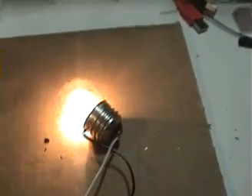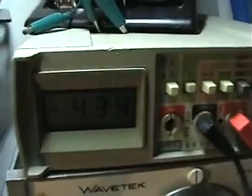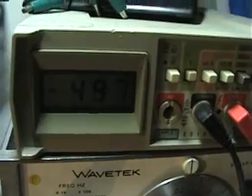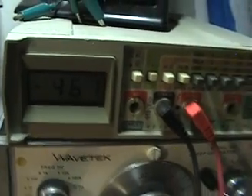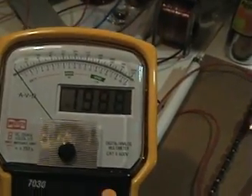The bulb is fully lit — I'd say there's probably about 150 volts. I can't measure it because my equipment goes haywire. My Fluke voltmeter isn't even hooked up and it's showing nearly minus 500 volts — it goes completely berserk. My other meter is also going berserk, and my laptop monitor is just flashing. There's a lot of RF happening around this.